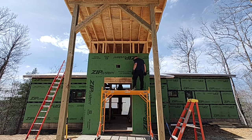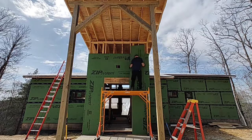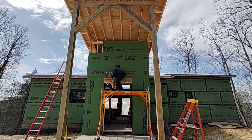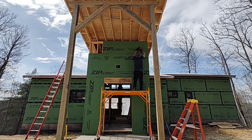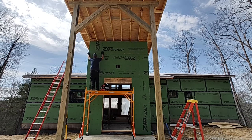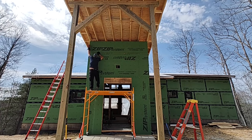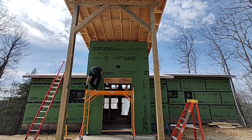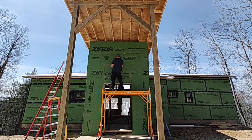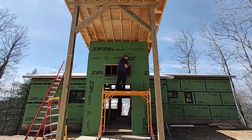When I'm patching in pieces like this I don't get too hung up on the measurements. Anything that's hanging over I can just go back and route down with the router and hit all the edges. I'll be knocking out the picture window opening in a minute doing the same thing. I have scrap zip sheathing from other sections of the house that I've stacked up and saved for things like this when I need small pieces. I just throw it on, then start routing out the areas I want, smooth off the sides, tape the corners and all the seams, and we'll be ready to go.